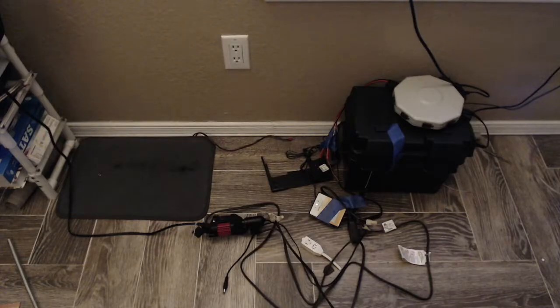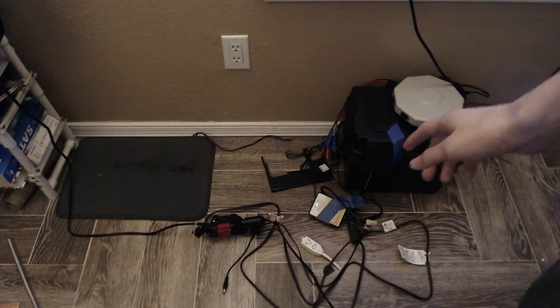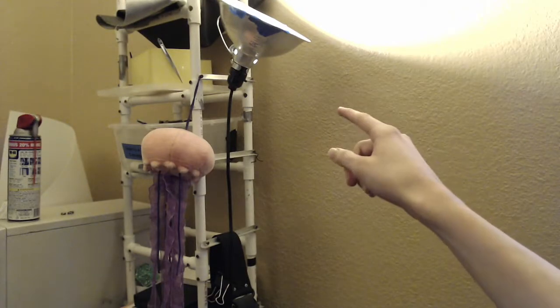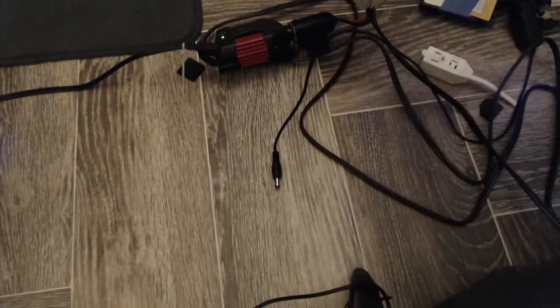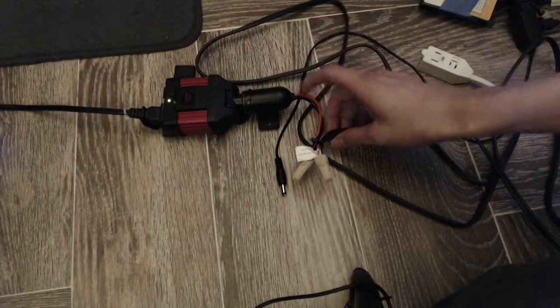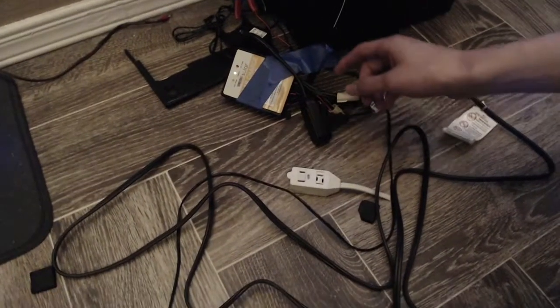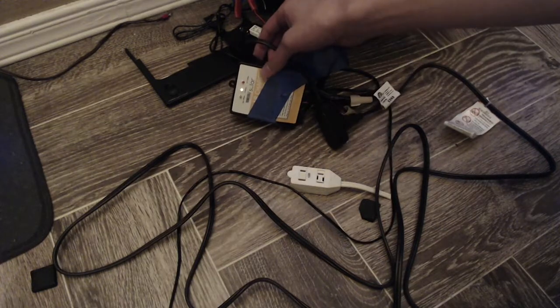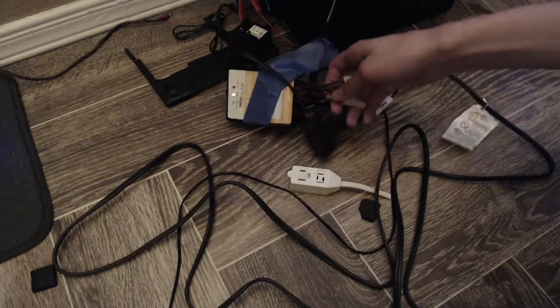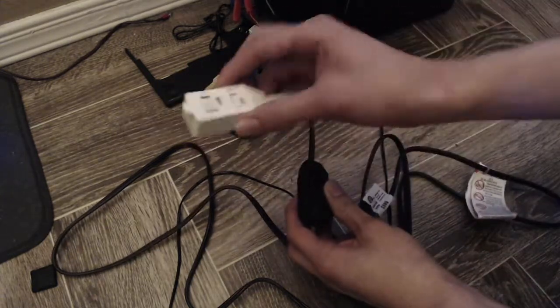Okay so here is our outlet hooked up. Basically what I did — you can see the lighting in this room: I am lighting this room with an LED light which is right there, and that LED light goes into this inverter which goes directly into the outlet. This is the small inverter that I have — you can see the plug comes out and it just goes to this wire, which connects to a solar charge controller. This is where the power is coming from. You can see that the sun is setting at this moment so we are still getting some power. That power goes to the inverter, and how it works is there are just wire nuts on the load part of the charge controller, so you just get an outlet — this is basically just one of these outlets coming off.